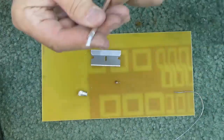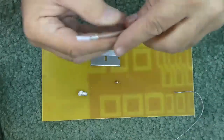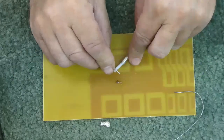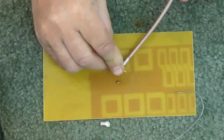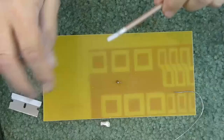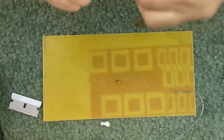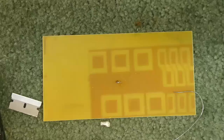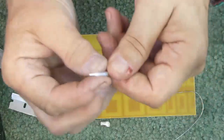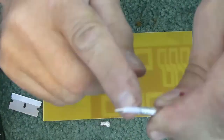The braid is off — there's a pretty neat looking end on the braid. To do the center, I have to be very careful that I don't cut too far into it, so I want to use either something a little dull or real light pressure. I roll the coax, or I could roll the knife or sharp edge around it. I get a little cut in the insulation, pull it off, and there we have a nice clean end with good dielectric and a nice shield with a good abrupt end.